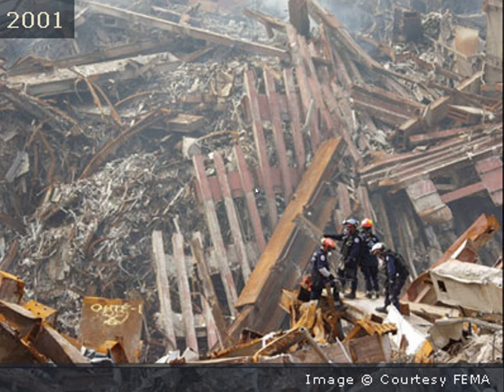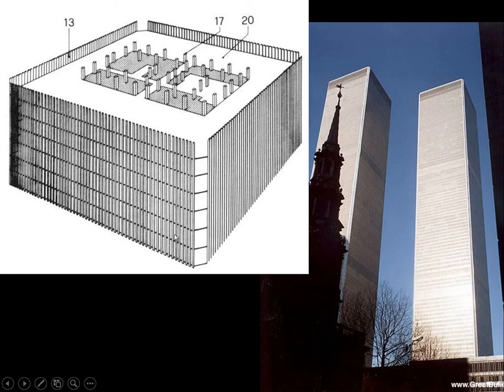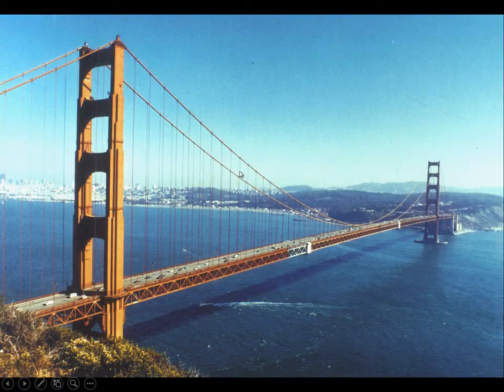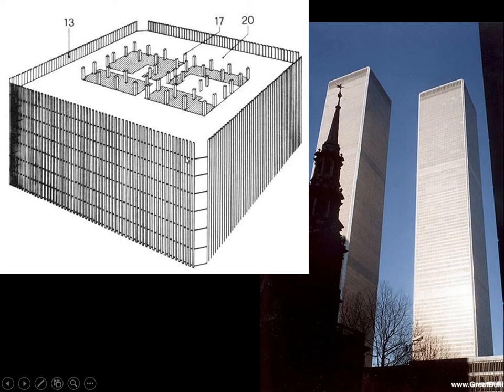It met code as prescribed at the time the building was built. This shows the structure with that dense tubular structure. These are deep horizontal elements welded in there, and basically if you look at this wall you see these really deep horizontals and huge numbers of those verticals moment connected to each other to create an extremely high degree of stability under vertical force — and also excellent resistance to horizontal forces as long as this façade doesn't detach from the floors. But that's what happened: this façade, which is very thin and crucially stabilized by the floors, once it detached, you began to have a compressive failure that could not be stopped.